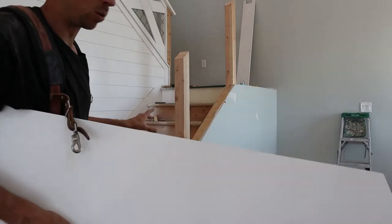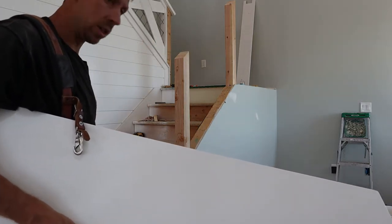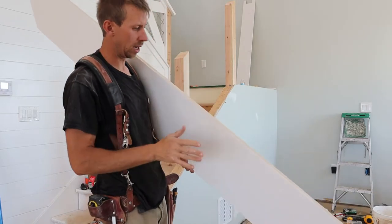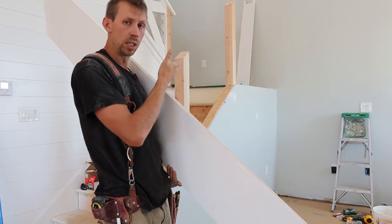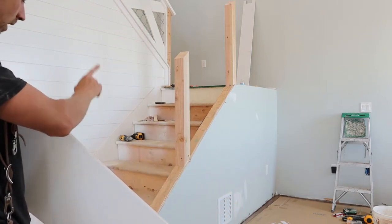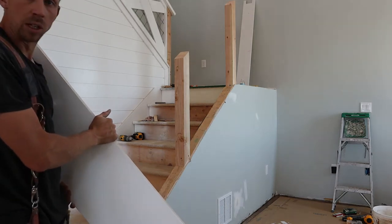Now that I got my posts installed - the ones I need access to from underneath the floor or wall I can shim and get them plumb. This is my stringer trim board, it's pre-painted. I'm going to go ahead and install them right by the stringers or stairs because now I no longer need to get down in that wall. I'm going to install this, then cap it with our one by eight, then finish installing the remaining posts and move on to actually building this railing.